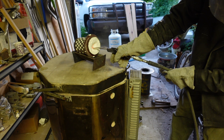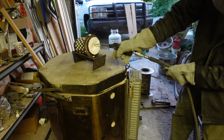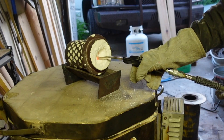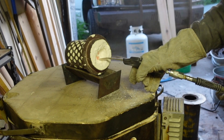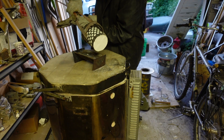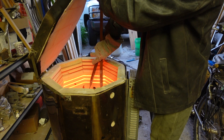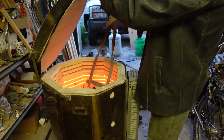And you can see there's more ash than I thought there'd be. I'll put it back in the kiln so it heats up to pouring temperature. I want the flask super hot so all that metal can get in those small details before it freezes.